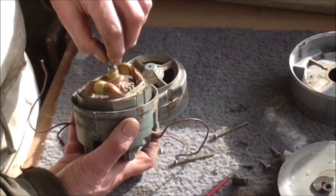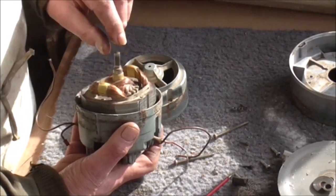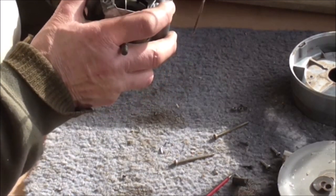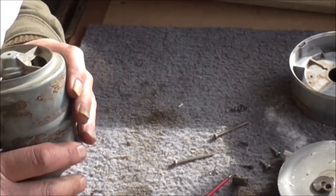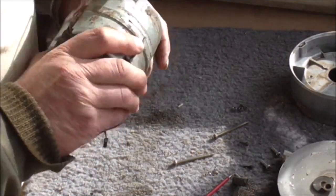I'm now going to put the end cap on. I've smeared the tiniest bit of grease on there - you're not supposed to grease phosphor bronze bearings, but it's an old machine anyway and I've just put the tiniest bit, you can't even see it. I'm going to put the end cap on - make sure you've got these holes lined up and make sure the field coils are still in the right position so we don't get a lot of sparking.